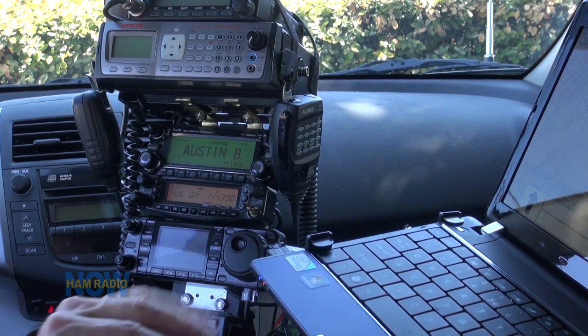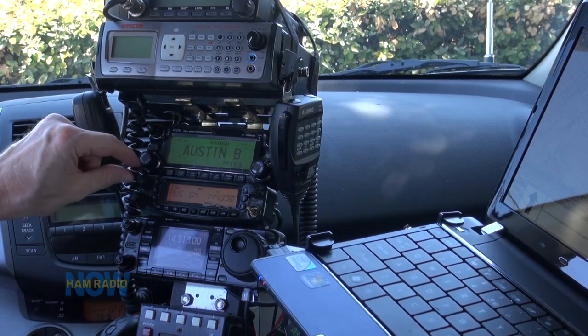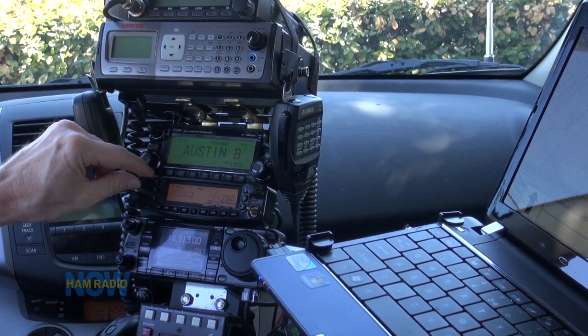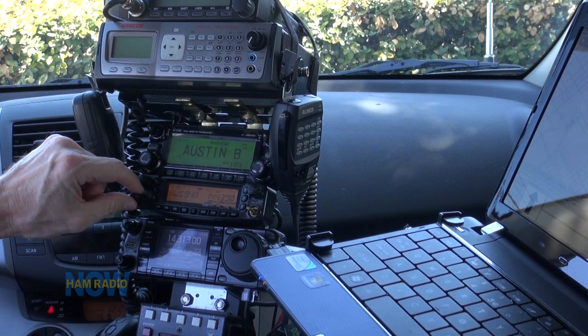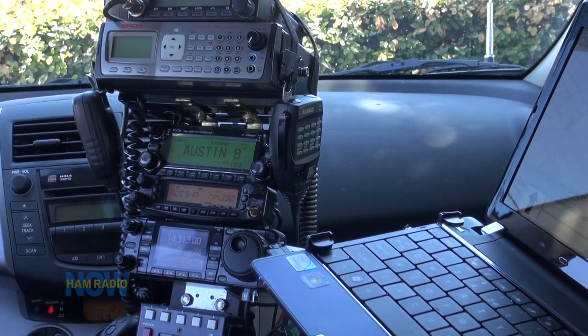The 2820 is still hunting for GPS. I have to be fair — the GPS antenna is not sitting right at a window, it's sitting down a foot or so. But eventually it locks and stays locked — it just takes a long time. I was going to show you what I did with programming for the analog radio, the Yaesu 8900. There are a lot of frequencies to program in. In any given area you'll get a dozen or more, and I'm probably not going to spend much time on any of those repeaters — so it's not worth a lot of effort for over-the-road.